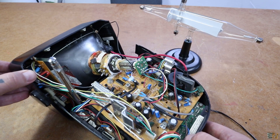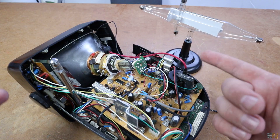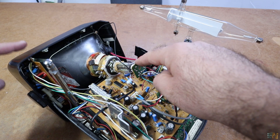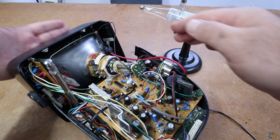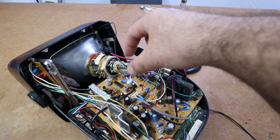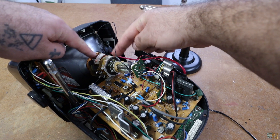So I have my TV open — let's start the dissection. We don't care about this part, because it's for processing the radio signal. We do care about this — this is the flyback transformer creating the high voltage needed for the electron gun, with the positive connected to the anode. This is basically the entire tube — the same as that small tube. This will be the cathode and the anode is on the other side. As you can see, it's made of glass. The only difference is that the tube is flat on this side and open to create the screen. We have the positive on this side and the negative right here — and this is the electron gun, where the electrons are created using high voltage. Those electrons go and hit the screen, creating our dot.